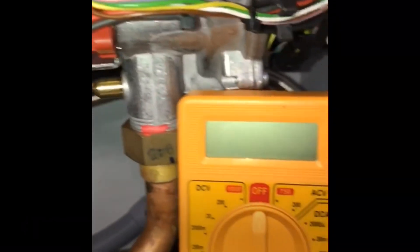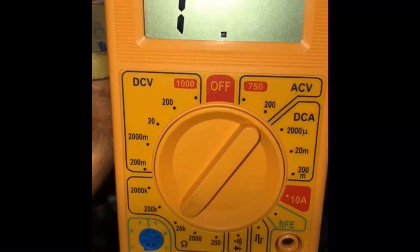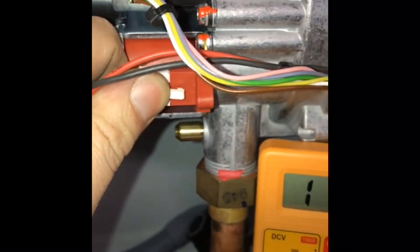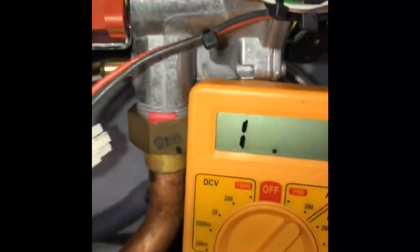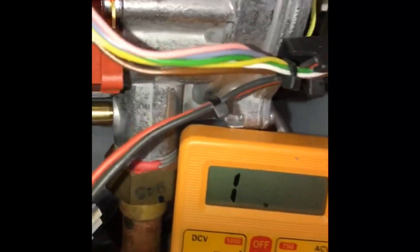That's working. So here we are to do a resistance on this gas valve — we're going to change this to ohms, looking at a 10% allowance. Just connect the probes, remember power supply is off, disconnect the hose. I'm going to go from the top.